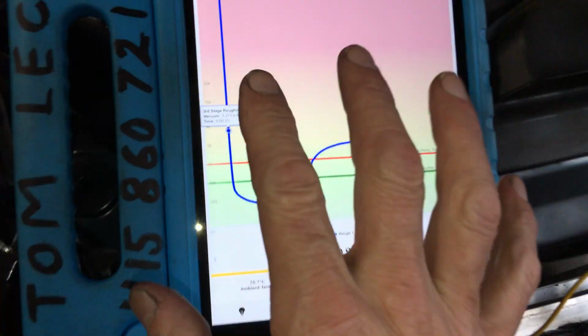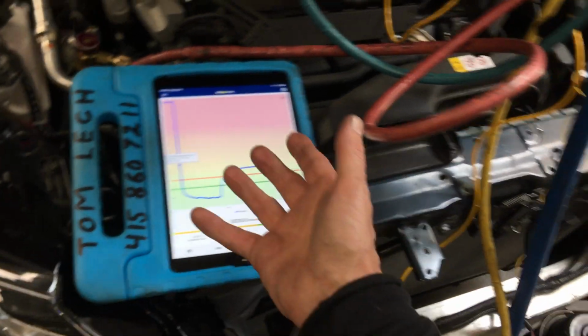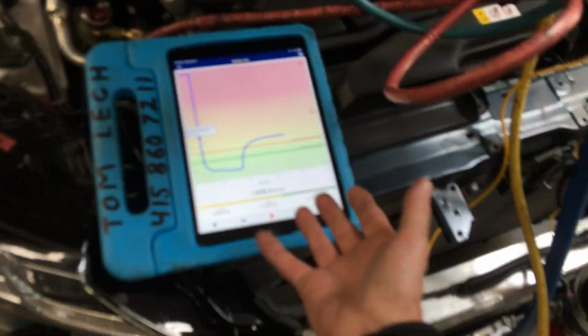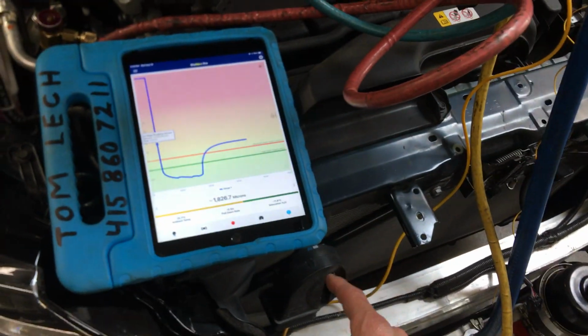You see that? You can actually graph out your micron. Now when I'm doing large commissioning on a big VRF unit for an LG system and it's 60 tons or something like that, 20 tons, this is what I do over a 24-hour period of time.